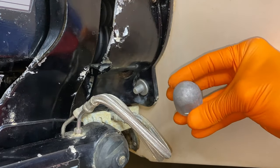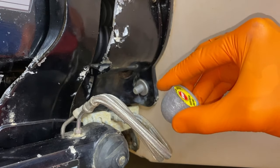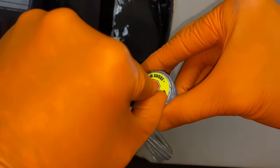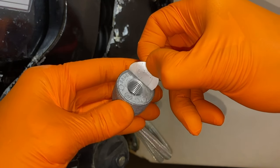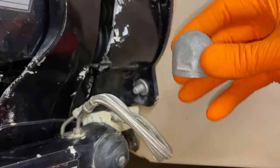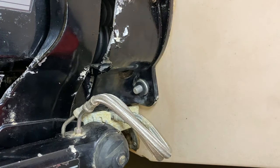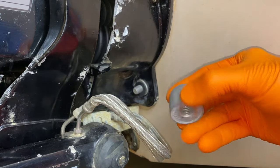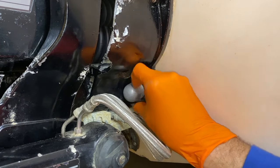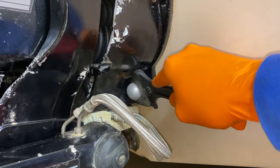If all looks good, we will grab our brand new anode. You can see the little flat spots engineered into the anodes themselves for allowing the wrench to get in place to loosen and tighten it. Check this out — 'Magnesium anode — fresh water use only.' All that is, is a sticker; we will remove that now. Before we install that, we need to install our brand new rubber washer on the threaded stud, as shown there. As you install the anode and turn it clockwise to secure it, do not cross-thread it. If you've got the thread lined up perfectly, it should screw on extremely easily. Hand tight, followed by the adjustable wrench — do not over-tighten these, but you want them snug.